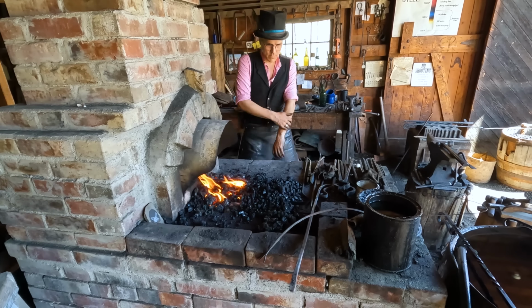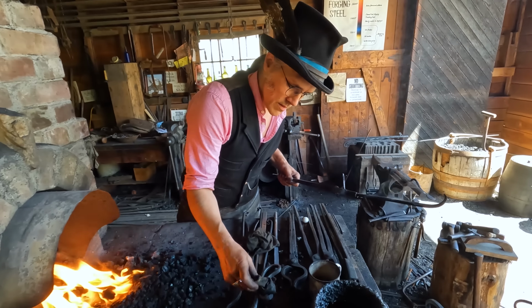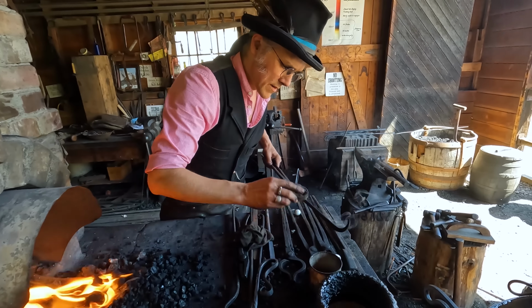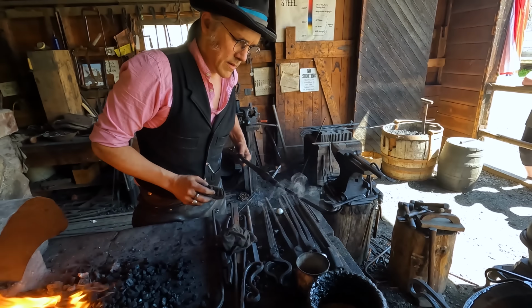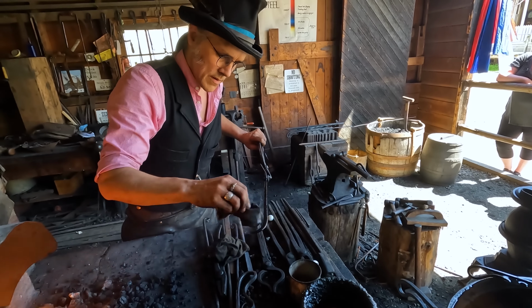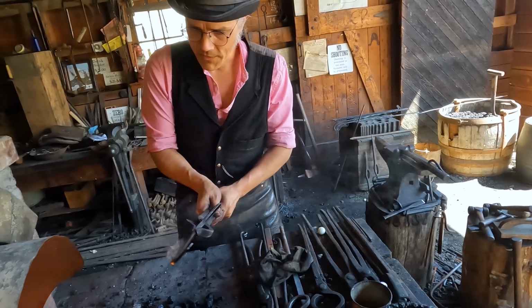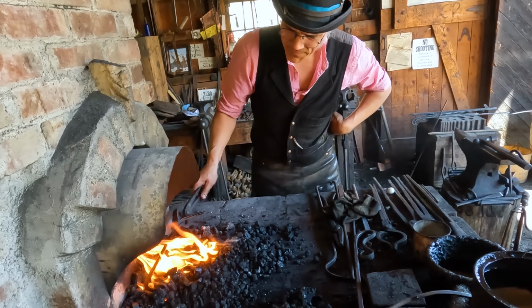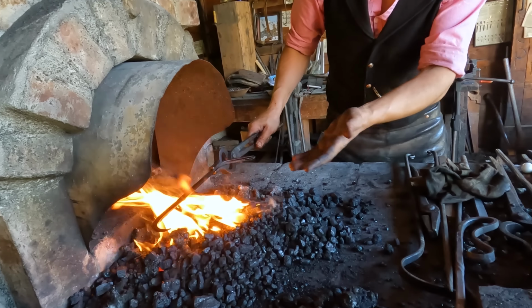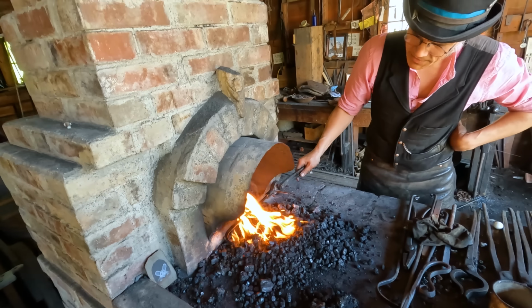And that thin layer of carbon on the surface will resist rust and helps protect the iron in the long term. So we'll touch the bar with a bit of oil just to see if it's hot enough. It's smoking. If it's not smoking, it's not hot enough. We're gonna put this back in now and bake the wet oil until it looks completely dry. And again, we're getting some soot on there from the fresh coal burning, just like seasoning a frying pan.